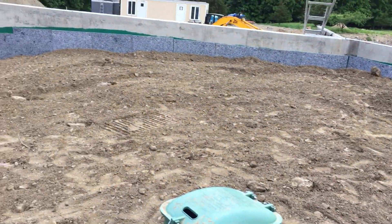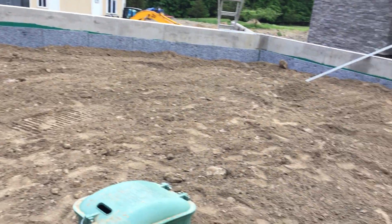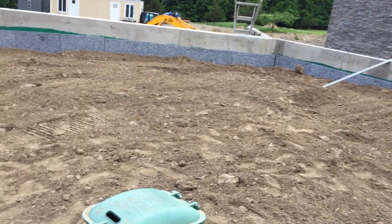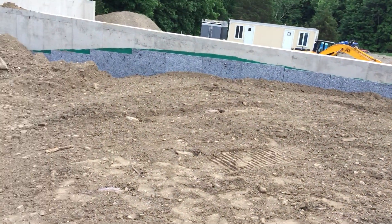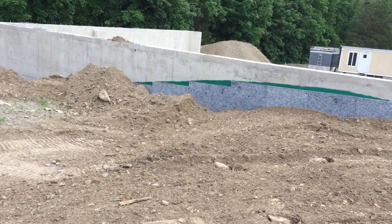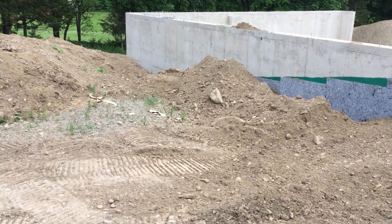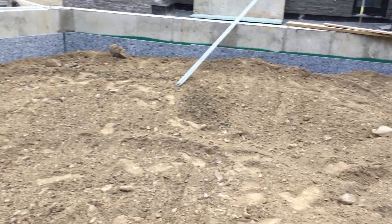It's all buried through here, which means that finishes off the need to have the open trench all along the house, because the backfilling and waterproofing has all been done, as you saw, with the green sealant and then the foam pad to protect the green sealant from the backfill. Some fine detail work still needs to come in here, but it's rough graded out, which is kind of nice.